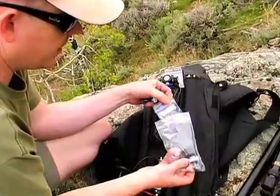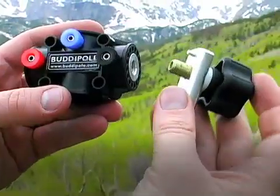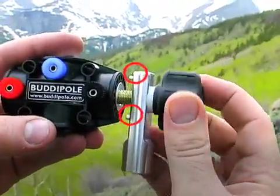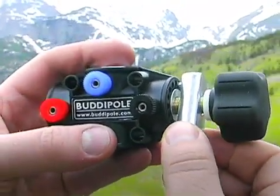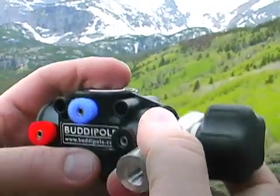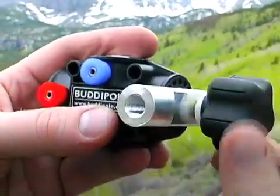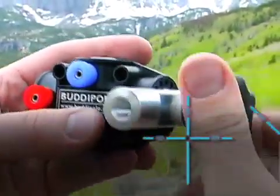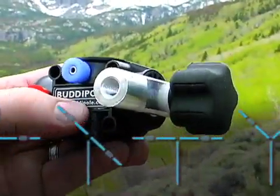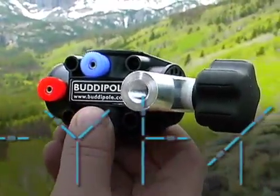The antenna also comes with a rotating arm kit. The rotating arms are nice — they allow you to make a number of different antenna configurations. There are two pins that have been milled out of the aluminum, and they can be placed anywhere around the hole pattern on any of the inserts of the Versa T, then just tightened down into place. This allows us to change the configurations of the antenna, and we can make slopers, Vs, inverted Vs, vertical dipoles, any number of different configurations.